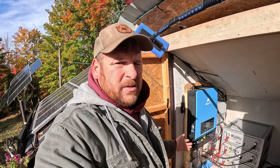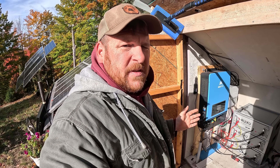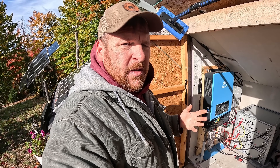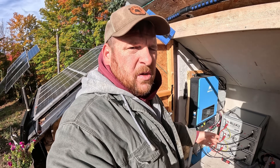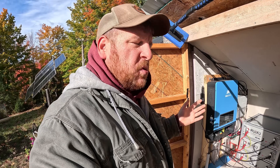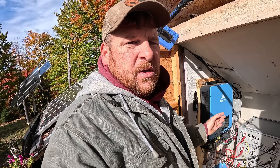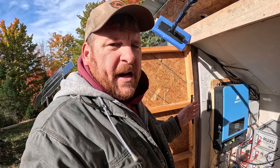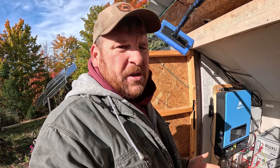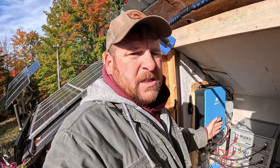All those settings on the SunGold make it look intimidating, but it's not intimidating — what it does is increase its versatility. Those settings make it so you can use it on-grid, off-grid, with different battery voltages, and control how you want to use the power. If you don't want to charge batteries and just want to use the energy, you could hook this system and solar panels to your house and put that PV voltage right into your grid or house and use that power. That's what I like about this — it's just versatile.